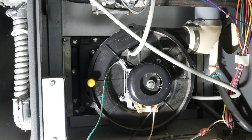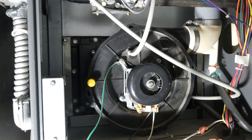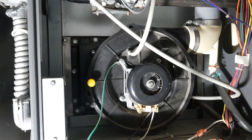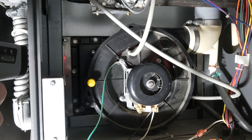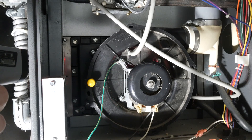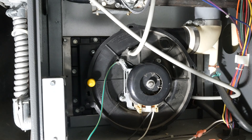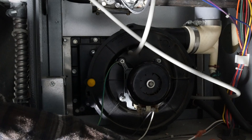What the circuit board is saying is: I'm providing power to this draft motor, but I'm not seeing any suction. That could mean the switch is bad, the motor is bad, or the bearing is bad. To troubleshoot that, I came up with two options. One, you could put a clamp meter on it to see how much current the motor is taking — that would tell you whether it's getting powered. I don't have a clamp meter at home, so I used a little infrared thermometer and lasered the outside of the motor housing.